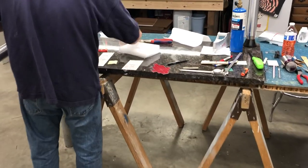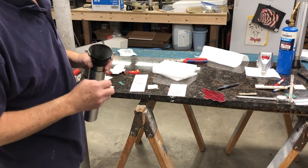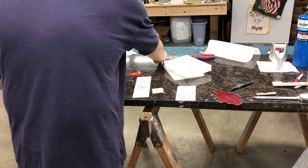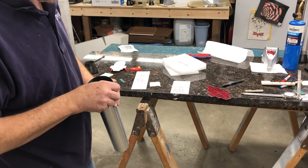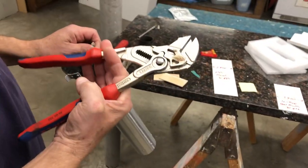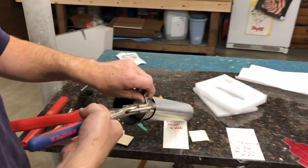They're aircraft rivets. The number is MS20470A4-4s. I'm gonna start including these in the install kit for whoever purchases them. And let me show you how you just put these in. I like to put the head on the inside. And these are fairly soft rivets. I use what's called Knipex pliers, where the jaws move parallel to each other, and you just pretty much squeeze them.